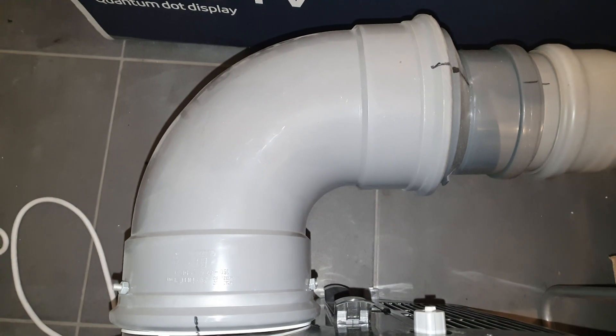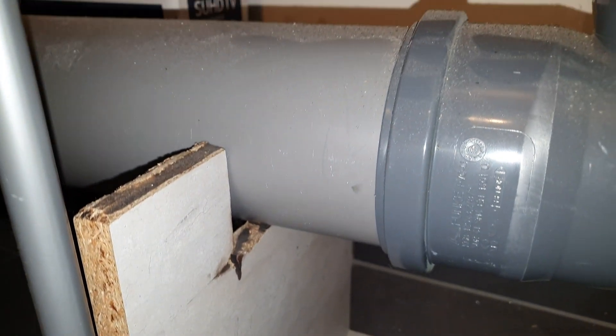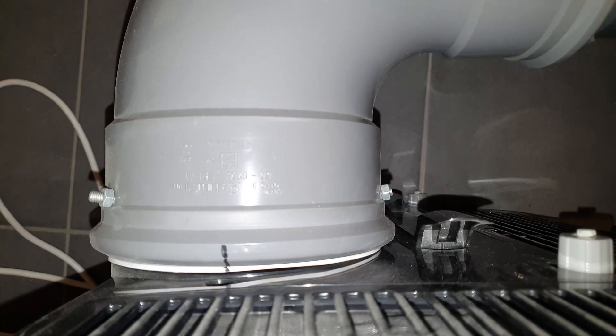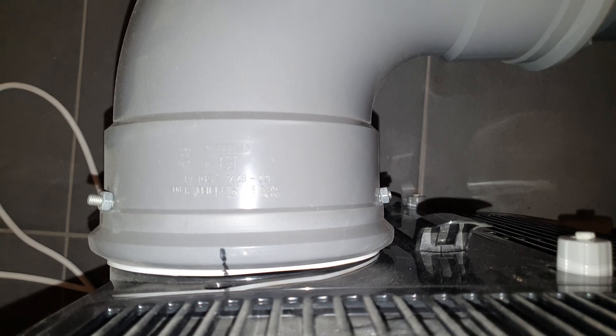That's why I've used these tubes in the back here that are actually meant for water in the ground. I used these plastic tubes because they are a lot thicker and stronger, and the inside is also way smoother than those flexible hoses, so it can dissipate the heat a lot more efficiently. I've also made a simple stand out of wood to hold the weight of all those tubes. I fitted the tube to the original adapter of the flexible hose by simply drilling three holes in the tube and into the adapter, and then securing it in place with some nuts and bolts.